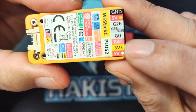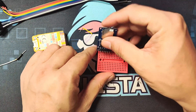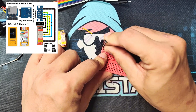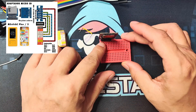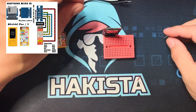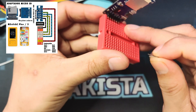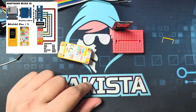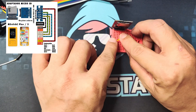It's important to know that some SD card modules have a 3.3V input, meaning you'll be putting it on 3.3V rather than 5V. The first thing we do is plug it into the breadboard. Based on the diagram, the CS should be grounded, so let's ground CS like this.